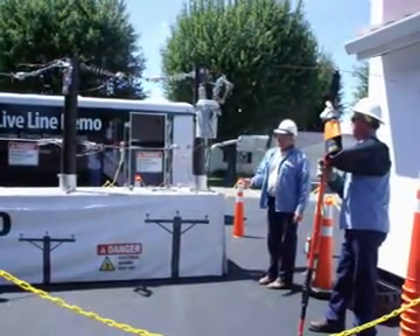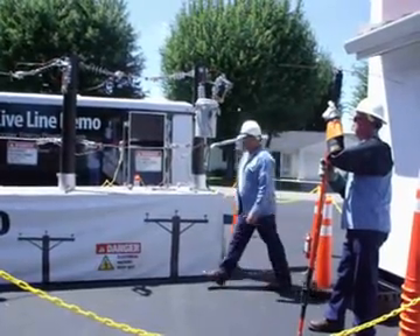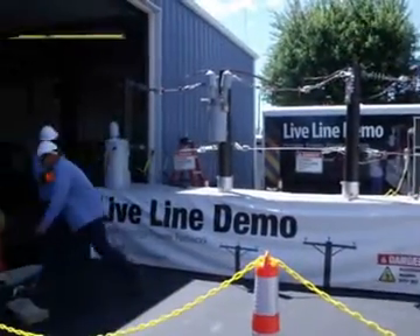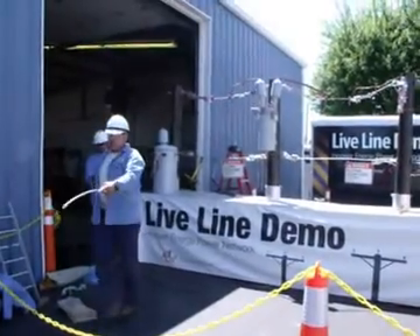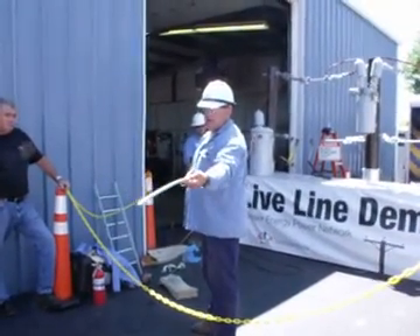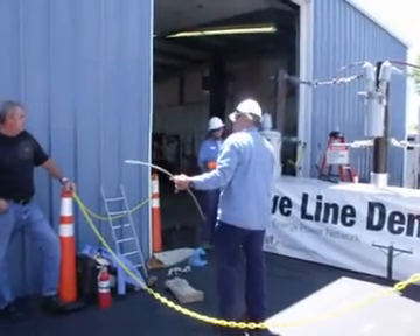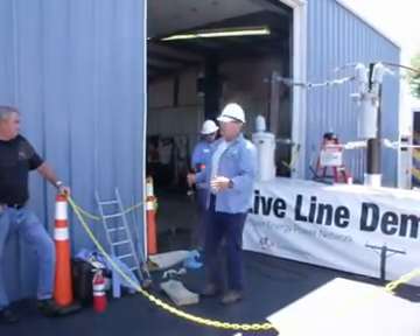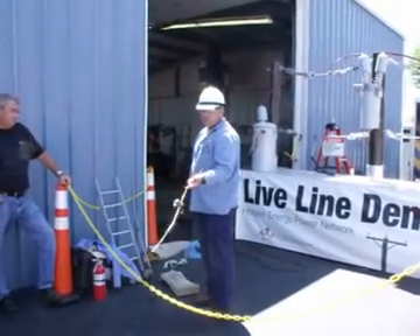Surges and stuff like that — every house. As you can see, this is all ACSR — that's a conductor you all hear about. It's aluminum, steel core — aluminum wrapped. Aluminum conductor, steel reinforced. That's ACSR. Straight copper — we don't have copper here.